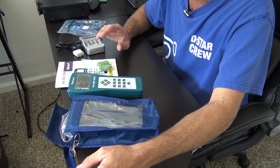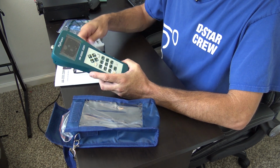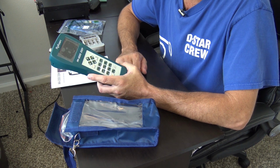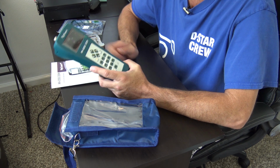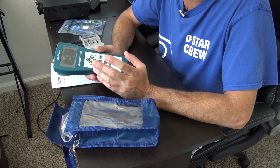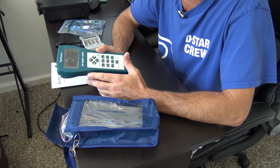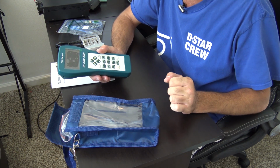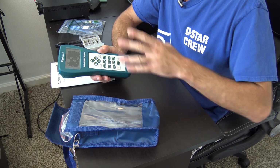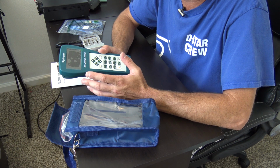Oh, and another thing with this device and the batteries, so again, from like 3 to 15 volts, this thing will not change accuracy. In fact, there was somebody that said you could put this in the refrigerator, get it cold, measure an antenna, then take it out, let it get hot in the sun, and measure it again, and the results are going to be the same. So temperature compensation, you don't have to compensate for what the temperature is outside or inside. Let this thing warm up.